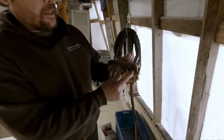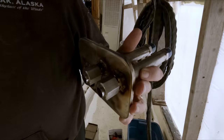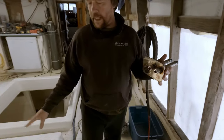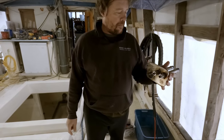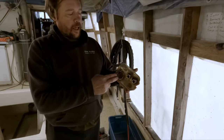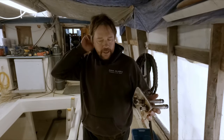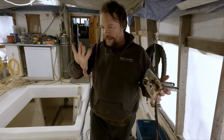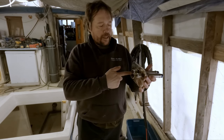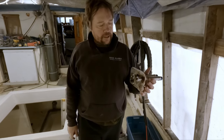These will be for the fuel lines. These are JIC fittings. We'll go into a piece of 1/2-inch tube, give it a little bend. That's going to make our connection to tie into our stainless pipes that we have in place already. And then we also have a 1¼-inch fitting, and we'll be able to thread in a piece of PVC into this. And after we get the bends in the pipe to bring it up about 6 inches, we'll just be able to glue it and slide it into the PVC socket that's threaded into here. And that'll finish those connections there.